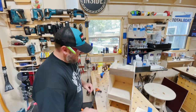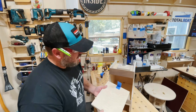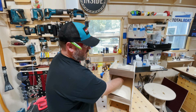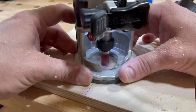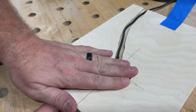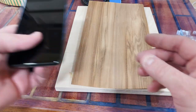Now I need to test the angle for the wireless phone charging — that's a feature I'm adding. Nothing's been routed yet, so I use blue tape as a reference to find the angle in the middle and determine where the wireless charger needs to be routed out. I make this in two passes — the first one shallower — and once I set the depth I take my time going really slow by hand, carving out the recess. Then I need a channel for the cord. I didn't adhere that cord as best I could and that's going to be problematic later.